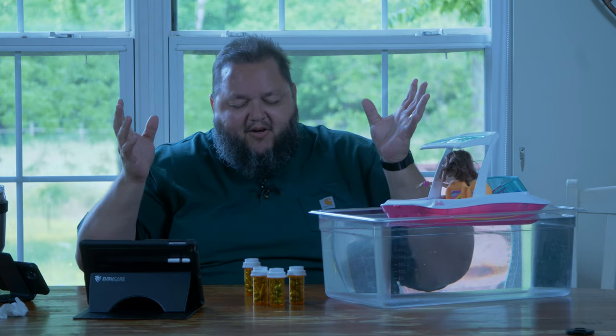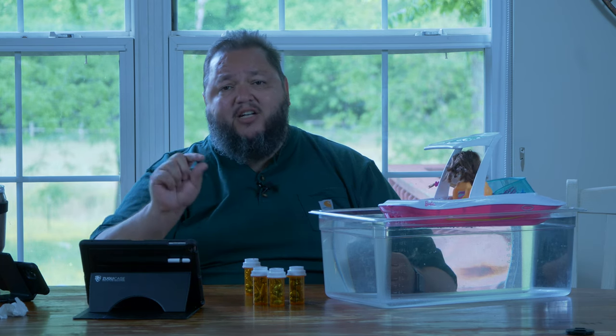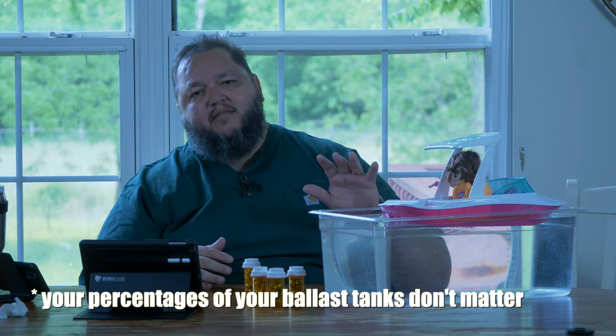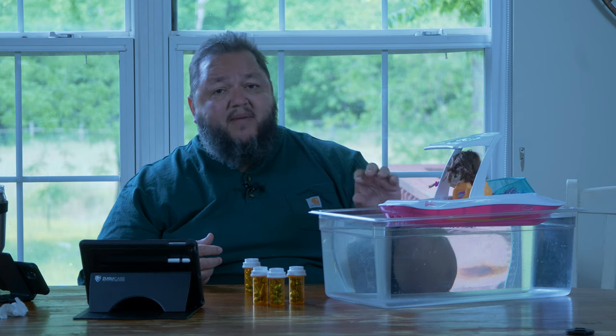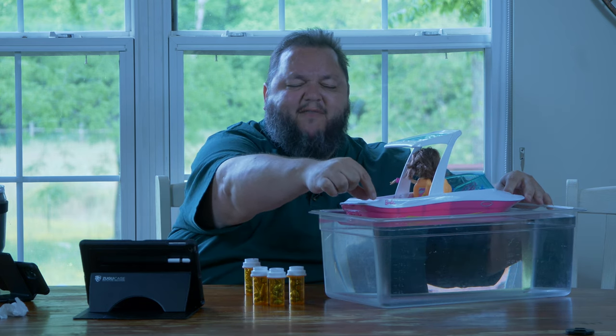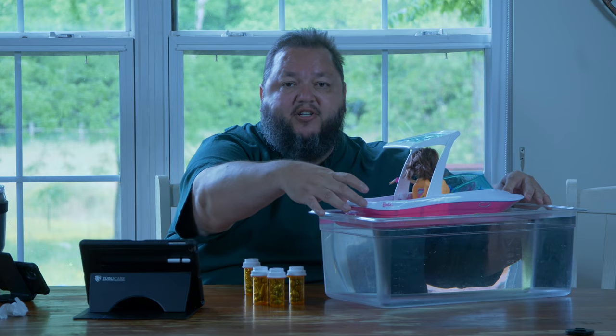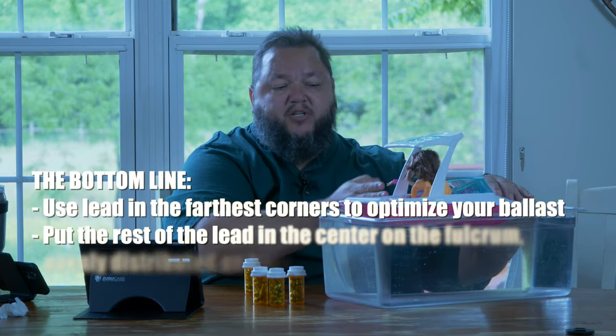Your percentages of your weights don't matter — they're never going to give you a consistent wake. What gives you a consistent wake is to set that pitch and roll and to measure and adjust it. If you maximize your weight with just a few hundred pounds of lead using leverage, when we put lead in the back we always put two 50-pound bags in the far, far back corner — it can't go farther back, there's just fiberglass and lake. We always put two bags in each corner so we have that leverage back there. The rest of the lead we put right on top of the fulcrum just to give us extra weight.